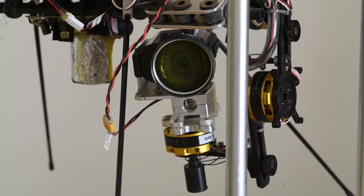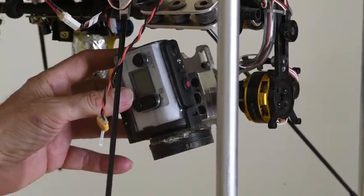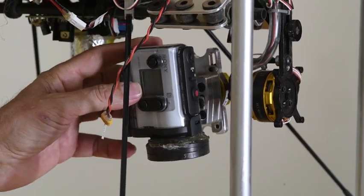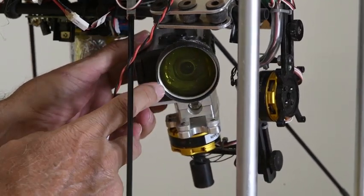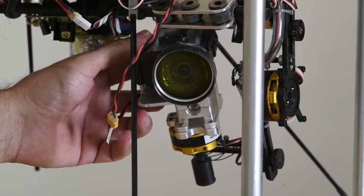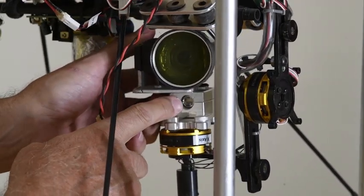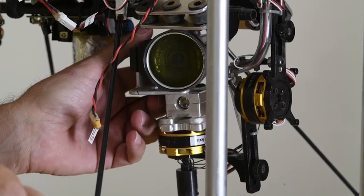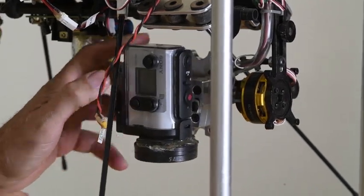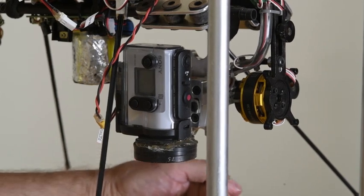All the technology of the drone — the autopilot control system and the gimbal — exists to fly these two instruments. First is this Sony low-light camera; it's an action sports camera particularly sensitive to low light, which is what we need to see the fluorescence. In front of the camera there's a filter that blocks the laser, which is very bright, so it can see only the fluorescence the laser produces. Right next to it is the laser — a blue laser with a specialized lens in front that spreads the single dot into a line about the width of the camera's view, and the drone flies forward scanning that line over the ground.